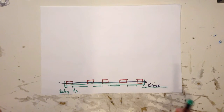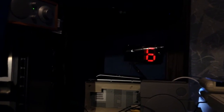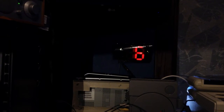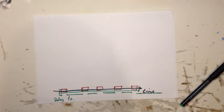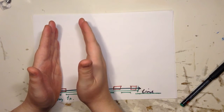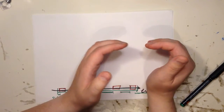But that doesn't really help you if, like, you have seen the thermometer over there. This thermometer reads the data using a one-wire protocol, and the one-wire protocol requires a certain time between bits. So bits are defined by the lengths between pulses. So if you can't read in the correct time, then you will miss data.